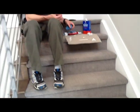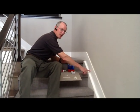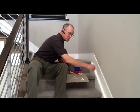The caulking is a white color so close to the white of the wood that you could almost not paint it and have it look pretty good. But the better thing to do is let that dry for several hours, then come back with the paint touch-up kit. Just dip a small brush in the little pail and paint down that line, going about an inch up onto the baseboard and out to the edge of the top of the stair stringer — just brush down it. It's a very simple thing to do, makes the area look a lot prettier, and it's just an item of homeowner maintenance that will be required from time to time.